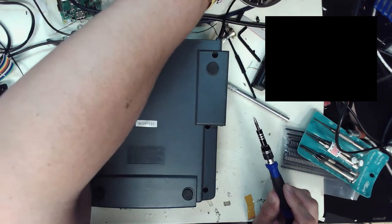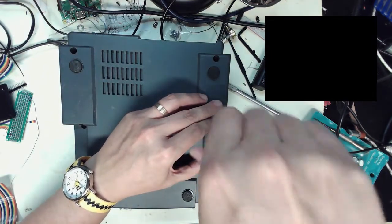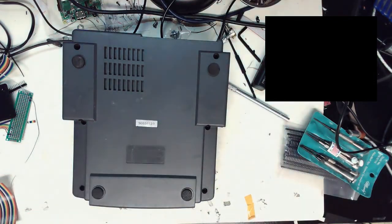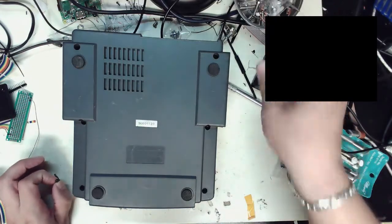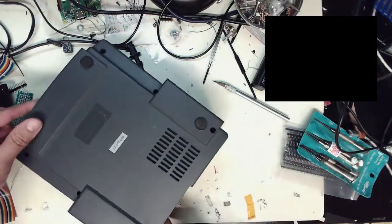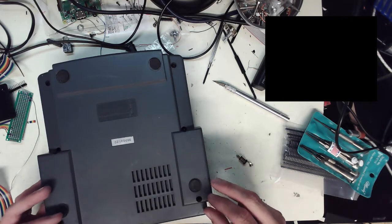So what I am doing now, I'm putting it back together again, and I'm going to make up a little connector with 5 pins on it so I can probe it externally. I want to see how short those pulse durations are. If I ever do come up with a solution for it, the length of those pulses is going to determine how fast of a system it's needed.